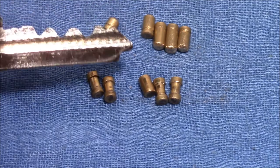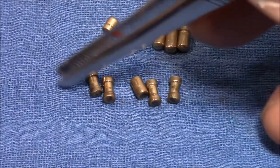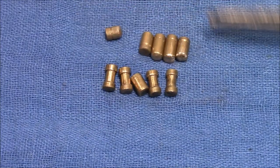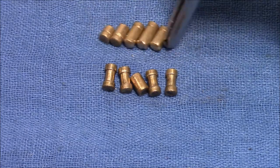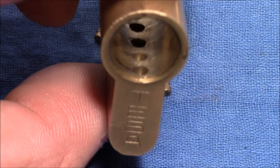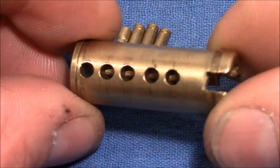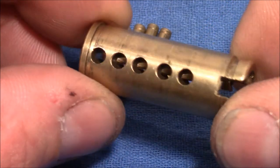I think I mixed it up, so... Oh, but it's symmetric. The drivers are symmetric, so it doesn't matter. Alright, yeah, that's the pinning. So nothing too spectacular. Let's have a look at the plug, the chambers in the body. Nothing special, everything smooth. But now the plug, beside of the gap between 3 and 4, also nothing special, everything smooth.